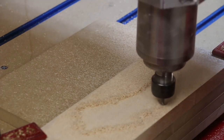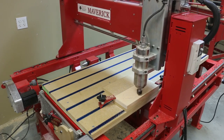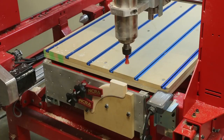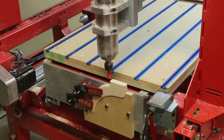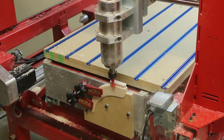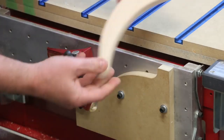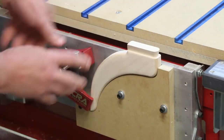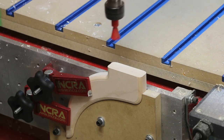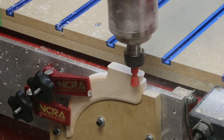The Maverick CNC can use a wide range of clamping systems, including a bench dock table with cam lock clamps that secure the blank from the sides and ends, a T-track table with toe clamps, or even a vacuum table for sheet processing. Once the legs are cut out, we'll use the vertical table to machine the dovetail joinery. The same 14-degree dovetail bit makes quick work of this process. A fixture was machined on the three-axis table to match the shape of the leg, and then bolted to the vertical table ensuring that the parts are clamped in the perfect position every time. The same type of clamps that fit the T-track on the three-axis table attach to the vertical table, creating an extremely versatile clamping system.